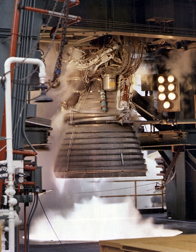The ASI operated continuously during the entire engine firing, was uncooled, and was capable of multiple re-ignitions under all environmental conditions. Thrust was transmitted through the gimbal mounted to the injector and oxidizer dome assembly, consisting of a compact, highly loaded universal joint with a spherical socket-type bearing covered with a Teflon fiberglass coating providing a dry, low-friction bearing surface. The gimbal included a lateral adjustment device for aligning the combustion chamber with the vehicle and provided a pivot bearing for deflection of the thrust vector, thus providing flight attitude control.